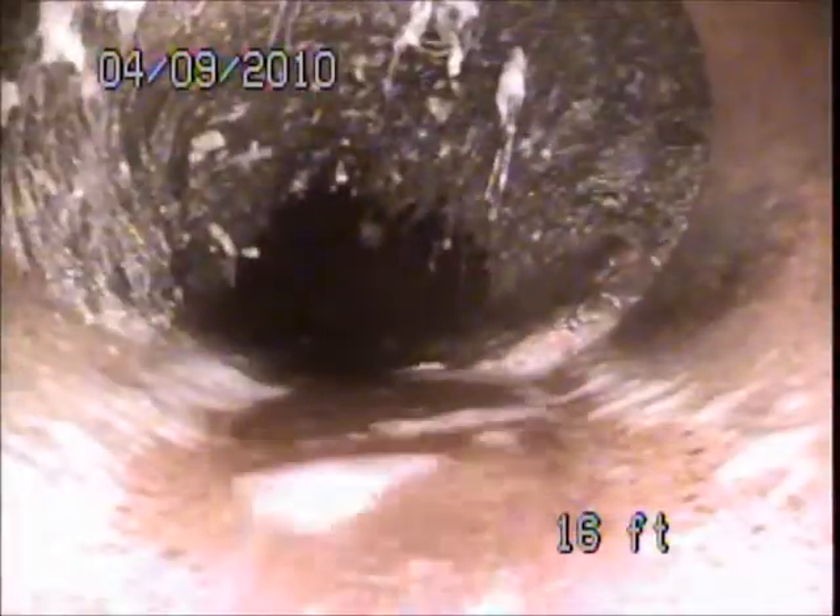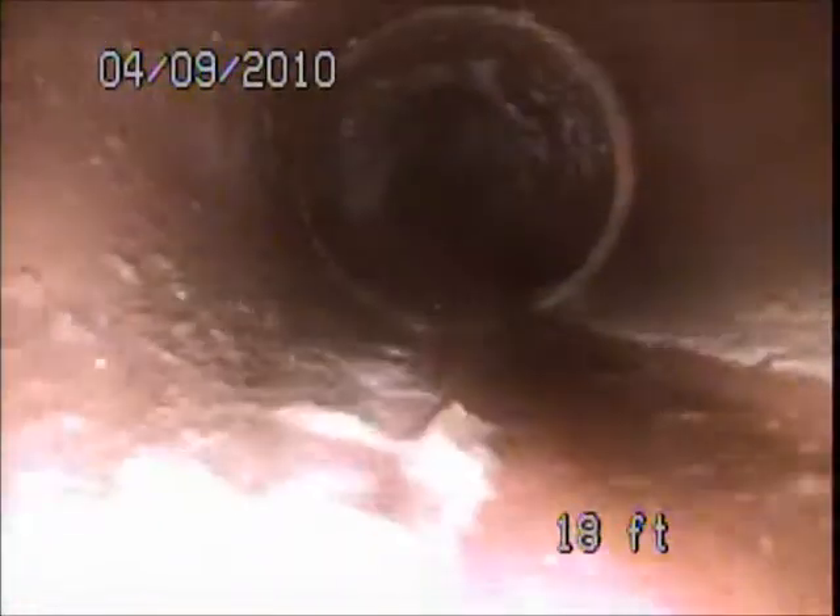And here we are looking into the city sewer, so it's not a very long sewer line. We do have a couple of areas of root intrusions — the roots need to be cleaned at this point. This section of the clay appears to be doing just fine. I'm going to go ahead and locate where the city sewer connection is actually taking place; it almost feels like it's on the sidewalk, not under the street. This is the most aggressive roots in the system. I'm going to recommend that cleaning be done now.